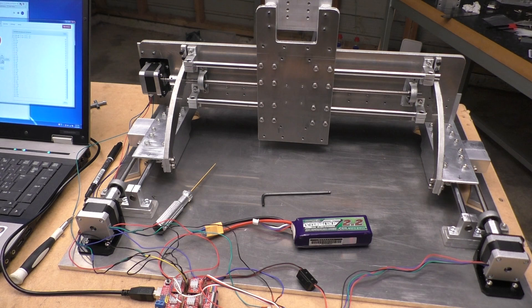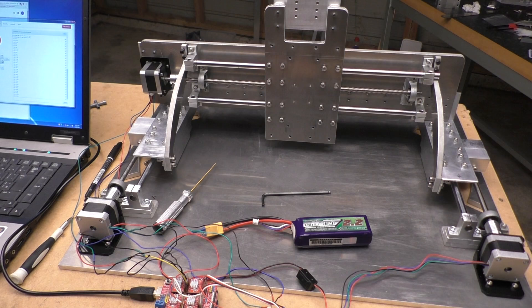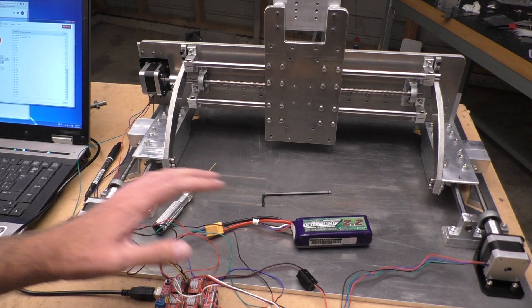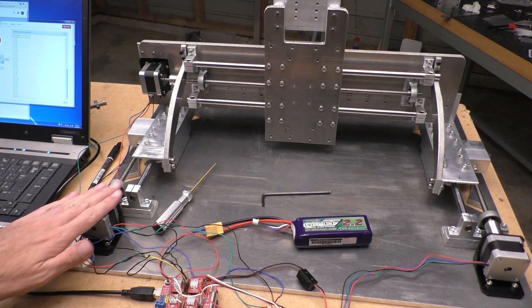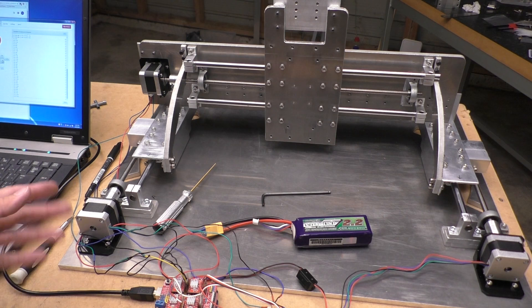Okay, that worked out alright. So now we have two axes going. I also changed something in the settings to say that the motors should stay powered when everything stops. So now I can't move anything because the motors are holding everything fixed. You can hear a high-pitched whining kind of noise coming from the motors because they're continuously being powered — it's being switched off and on because it's quarter steps.